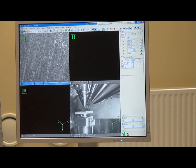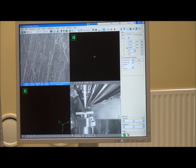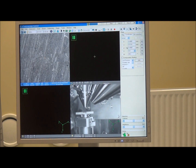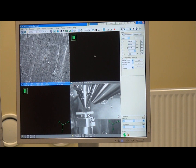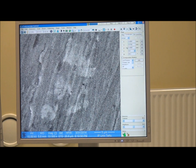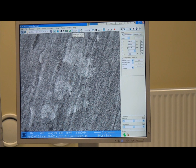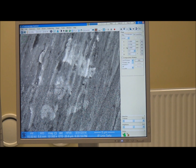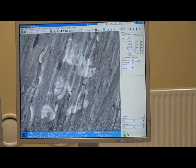Let's see what else we can find on the sample surface. I can easily move around by just clicking with the mouse, and when I have found some interesting place I will simply zoom in using just one button. Over here you can see some bright spots on the surface. Because this is an aluminum alloy we have some metal phases in it, and as you can see they look slightly different than the surrounding matrix — this is one of these crystal phases, and such phases give this alloy its mechanical strength.